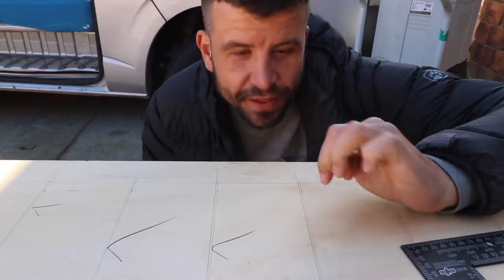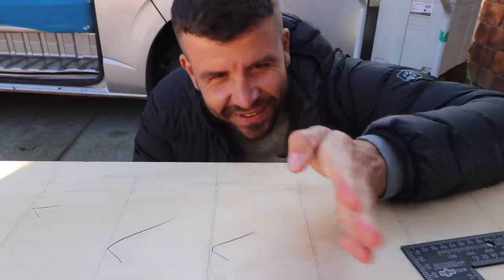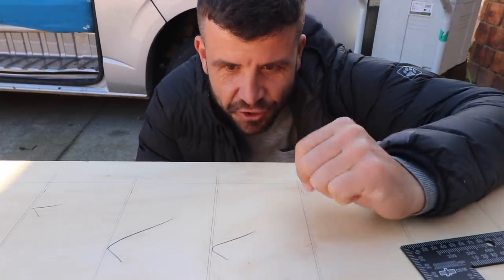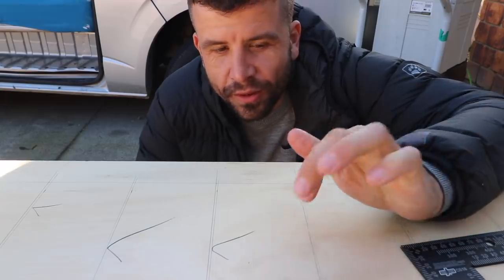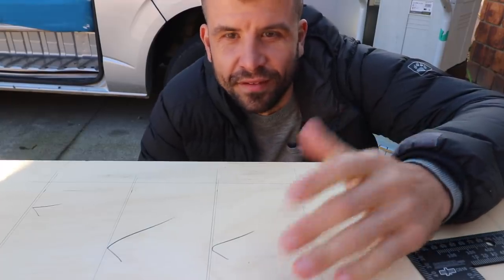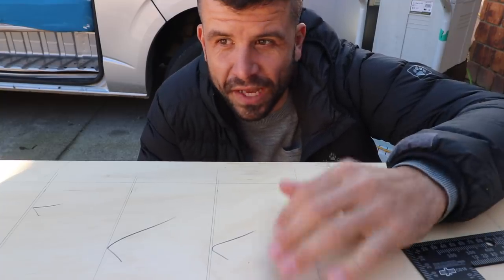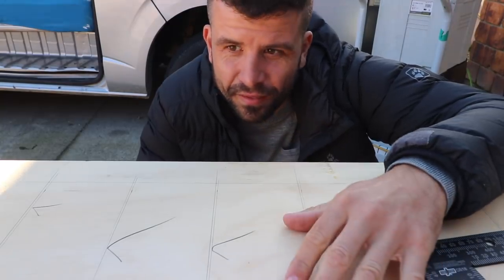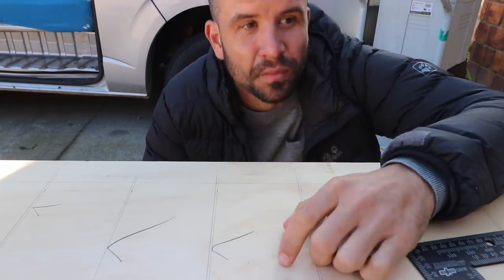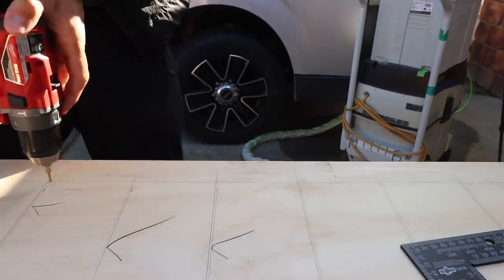And now, we drill 180 holes. You can see our miscalculations here. We started measuring from one side and then a couple of mil off and it just creeps out. So we corrected that, and the good thing here is we're only using the holes for clamping. I know the Festool tables and this Paulk table are designed to be a system where you can do square cuts, angle cuts, just by using the different holes, but we're not using it for that. So it's a modified workbench.